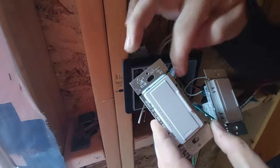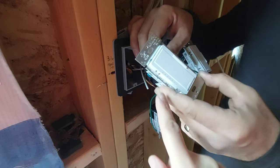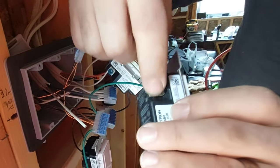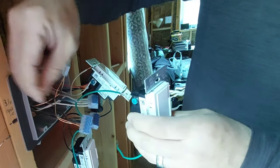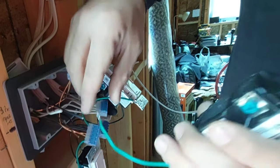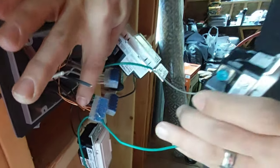Don't forget: if you removed the side tabs, that's minus 200 watts — but if it's LED, you don't need to worry about that. The third wire terminal is for use as a three-way switch, so if it's single-pole you don't need it. Connect the white wire to the white wire from the power, the ground to the ground wire, and also connect the ground on the switch itself.